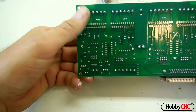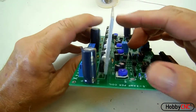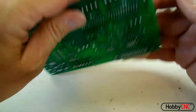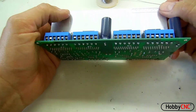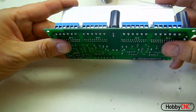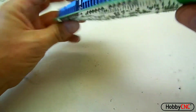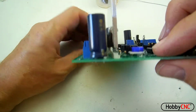So now it's still not soldered in, but I know that they're all perfectly aligned. I want to trim these pins — I want to use every bit of real estate I can for the heat sink. So I'm going to have them about a 32nd of an inch or so. Line it up relatively straight.